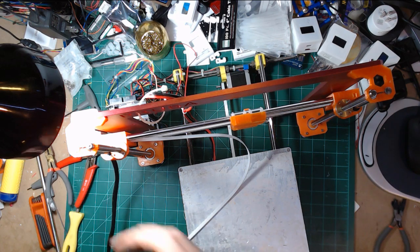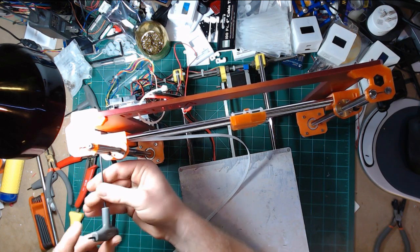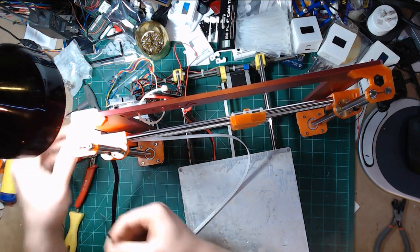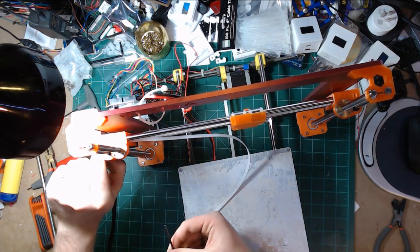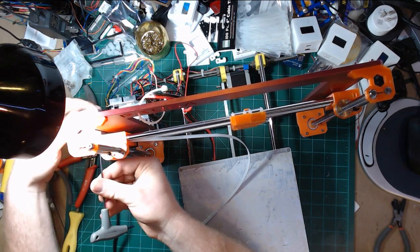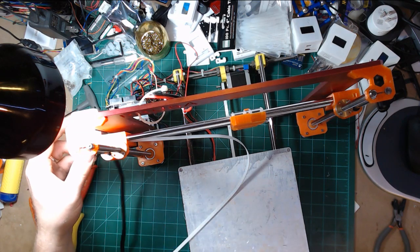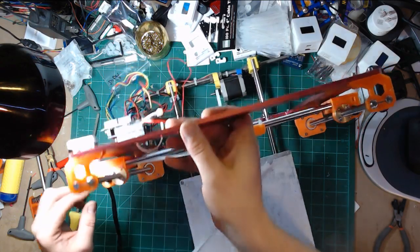Okay, so again, I need to take 2 of the screws out closest to the lead screw on the X motor. Loosen the 3rd screw, just so. Okay, this is not out yet. I'll take them out. Maybe not. Just so I can twist the motor. There we go. I can twist the motor now. So I'm able to twist the motor inside, which makes the pulley go inside, and that will allow me to tighten the belt.